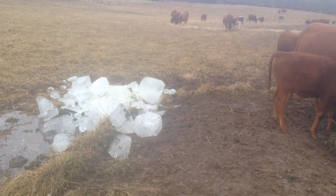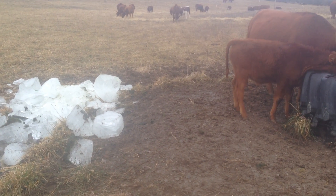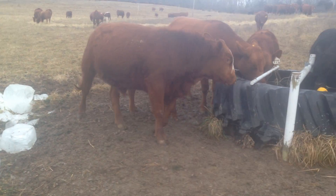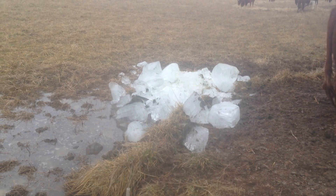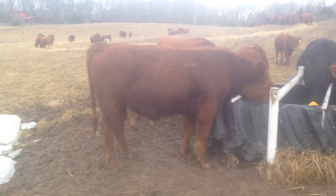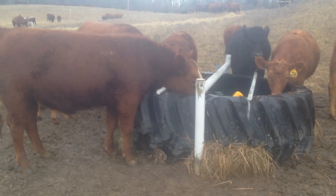If you drain the water out of that tank, you will never use it the rest of the winter because it'll freeze the water line. Leave the water in there, just chop the ice off when you come to it, and you're never going to have to chop it again. In the morning at 10 below you might get two or three inches on there, but nothing like what's here — that's two weeks of super cold weather. But you can see the cattle are in here; this is really high-quality water.